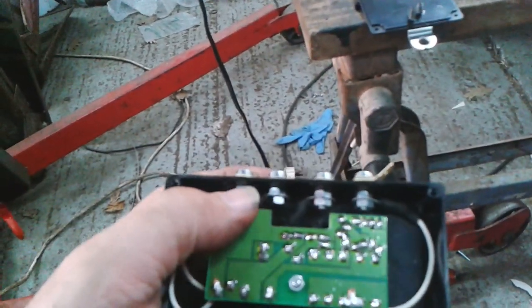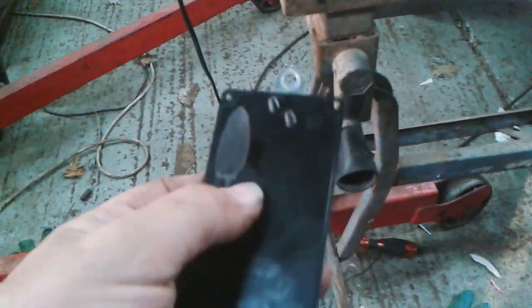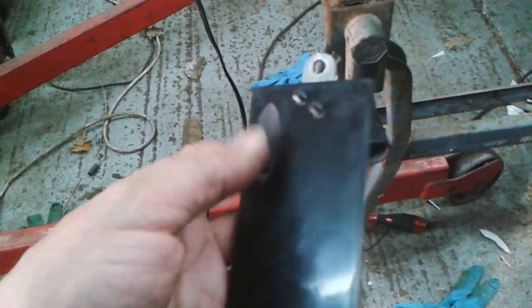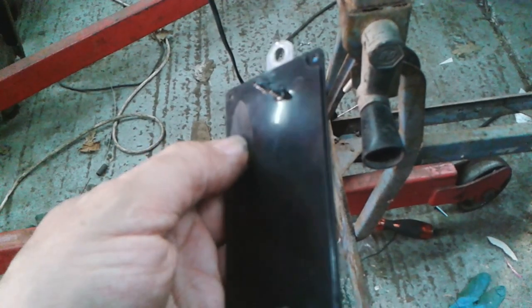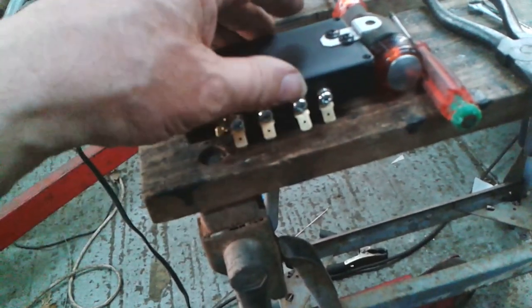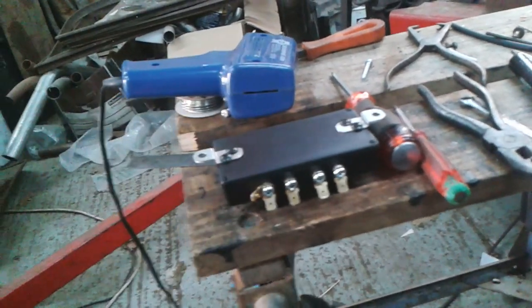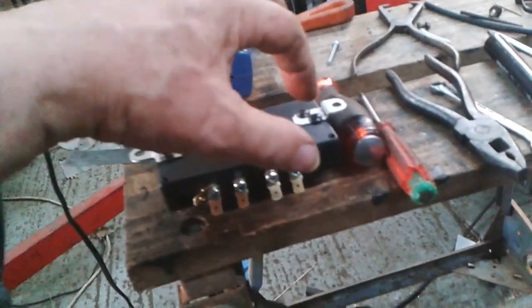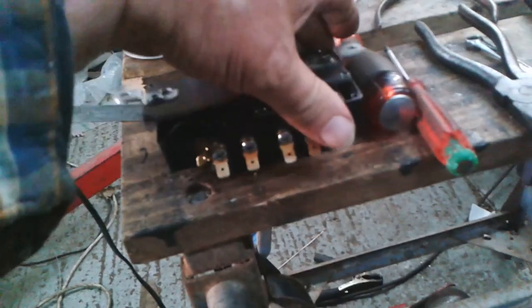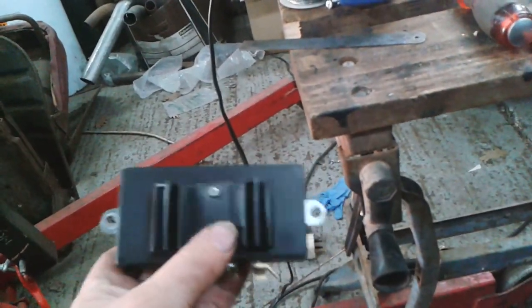I've got a very slight foul condition on this connection here on that bit of insulation. I put a bit of marker on it, put it on, noticed where it touched the marker, and just hit that with a grinder. It didn't do it very well but it has removed some material. Now this just clips into place nicely, goes into position without standing off. It does pop out but it's not fouling. These screws go into this area where there's plenty of clearance. That's quite a neat little unit now — there are four little screws that go in the back.